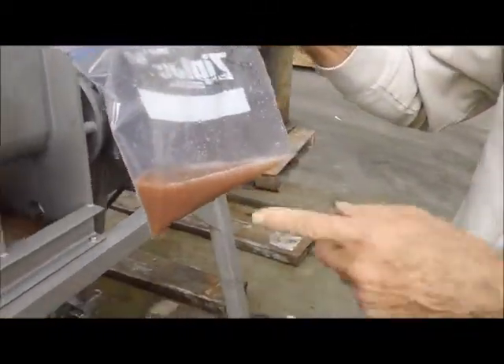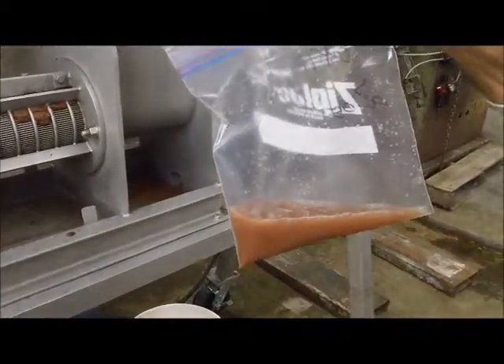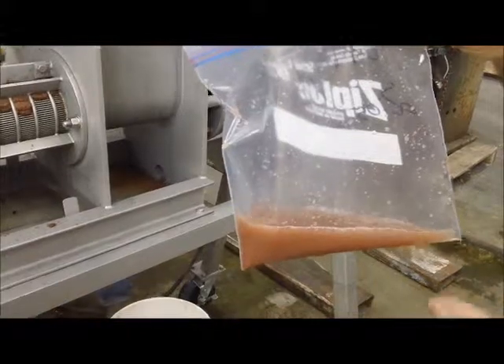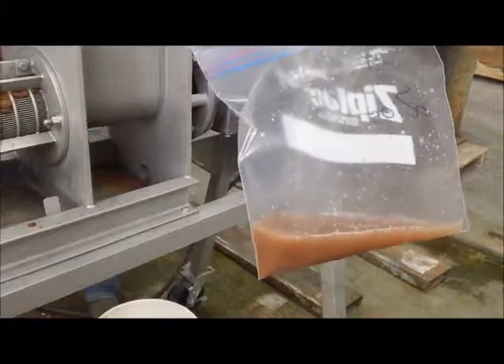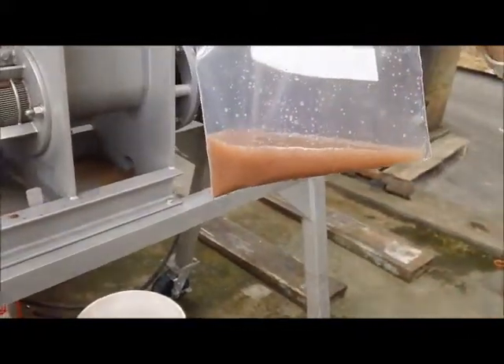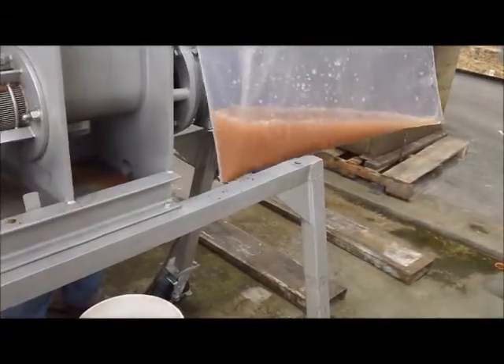There's a press liquid sample. Unless this is a high value liquid, we're not separating out enough to justify the screw press. This material has very little free liquid in it — when you squeeze it in your fist, you can't get hardly a drop out. So if it's going into a dryer, you're not getting enough savings to justify the press. If there's something good in here, then yes, it would be worthwhile.